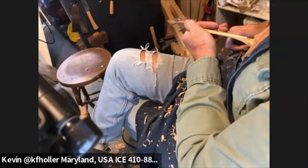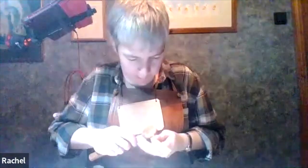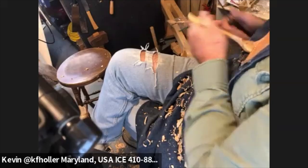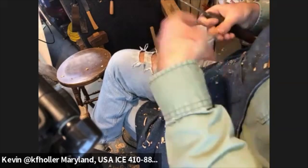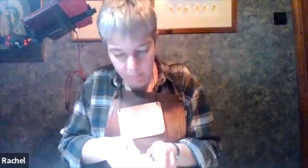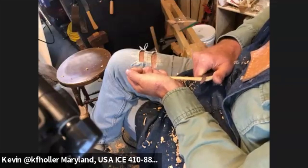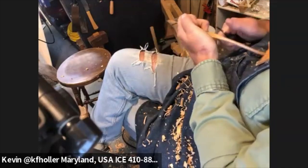It's funny, I have like two grain changes trying to do these facets on the handle. The tail flip and one in the middle of the tail flip. And so I'm continually sighting down the spoon to try and make sure I'm getting to see those corners and making sure that those are in line. Okay, so then I'm ready to finish off the bowl. If I faff with these facets, I'll never catch up to you. So this is going to be rounded over.